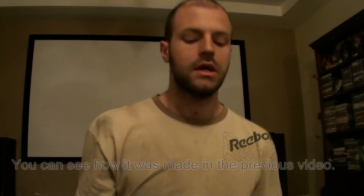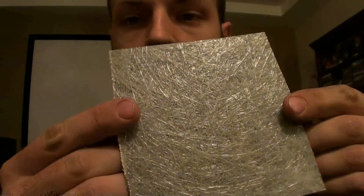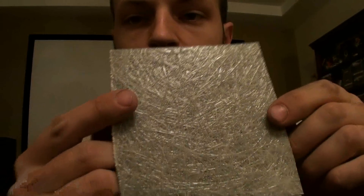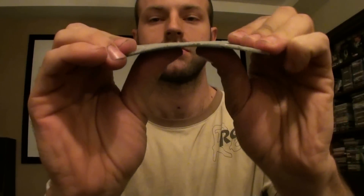I've got here several pieces I've just made of carbon fiber squares. I sprayed an epoxy resin gel coat with a spray gun, then brushed on all the layers, and used a roller after each layer to roll out the air bubbles. This piece has two layers of carbon fiber and then a layer of fiberglass — two 160g per square meter carbon sheets and then one 450g fiberglass — and it is somewhat flexible.